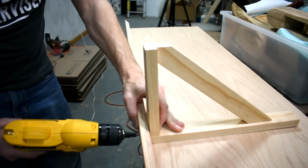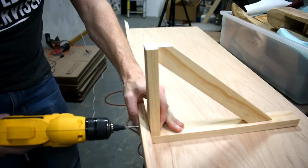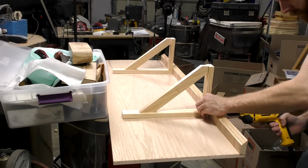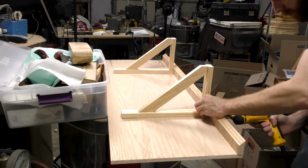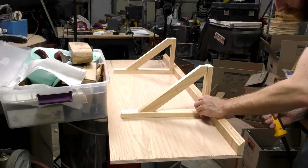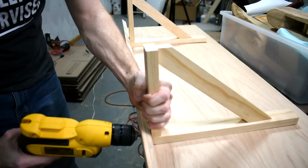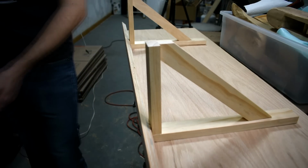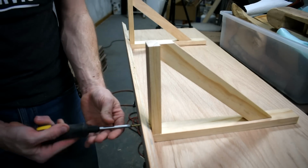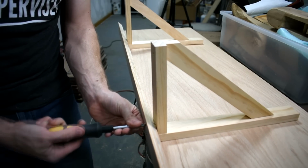I found it really easy to line up the supports on the shelf and cleat with the cleat already in place. The flat top of the board made it stand up pretty nice, and it just kind of slid nice, and I could hold it against the cleat while drilling, again drilling and putting in the countersink screws. I still used the countersink bit because sinking a countersink into the cleat and the 1x2, it didn't matter which one, allowed me to just screw the screw in nice and gentle, with a manual screwdriver. Didn't use any big power drills for this part.